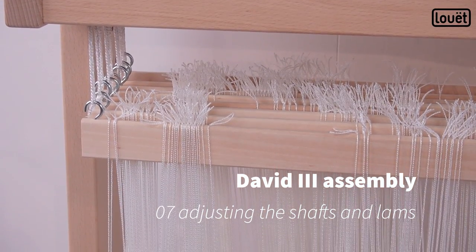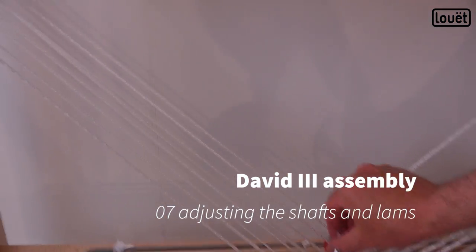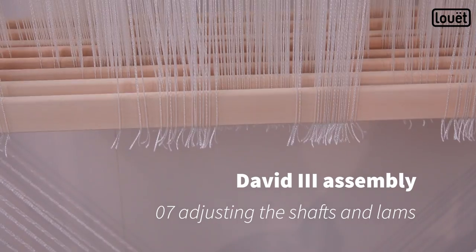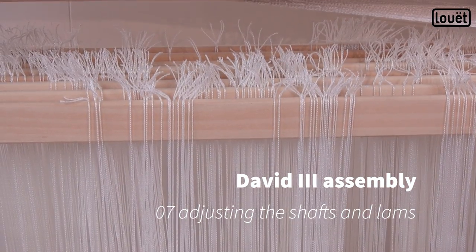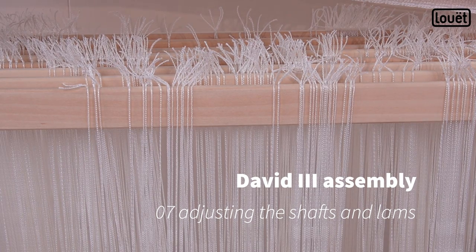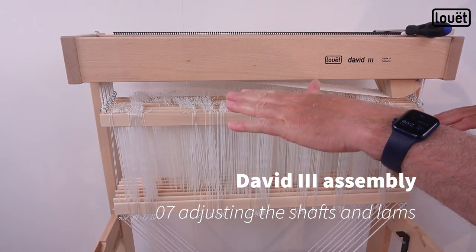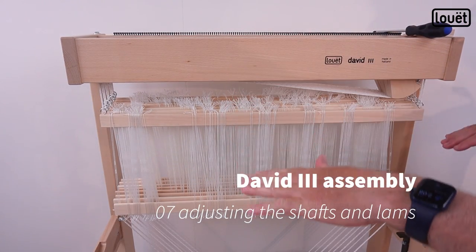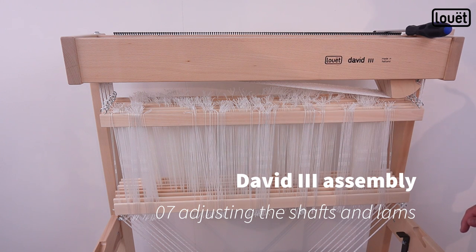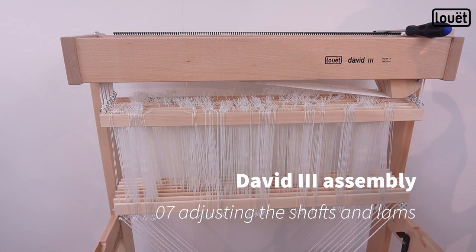And the whole thing is now a little bit low. So that last adjustment, I felt that, so when I adjusted the levelness, the left side came up, the right side goes down. As you're leveling, you're moving both sides a little bit at a time in opposite directions. Left side's going up, right side's going down, and that's when you're screwing the bolt inwards. And so you might be looking over here and you see that one is good, but then this one has gone too far, so it's kind of right in between that point.